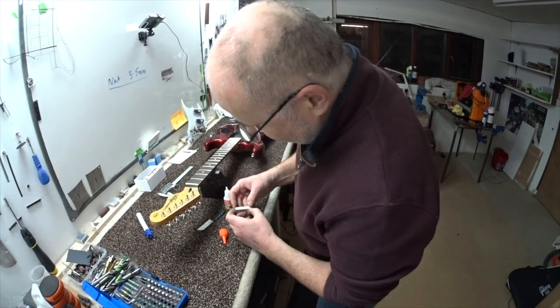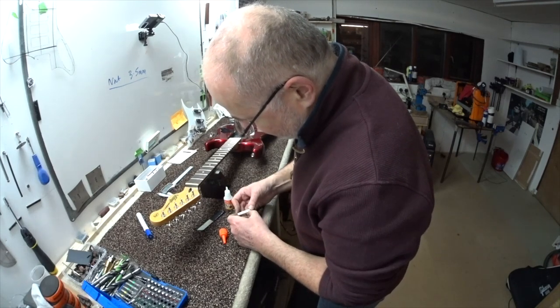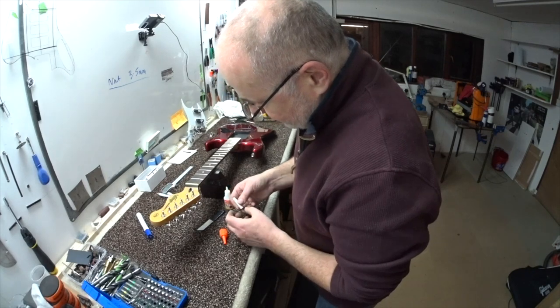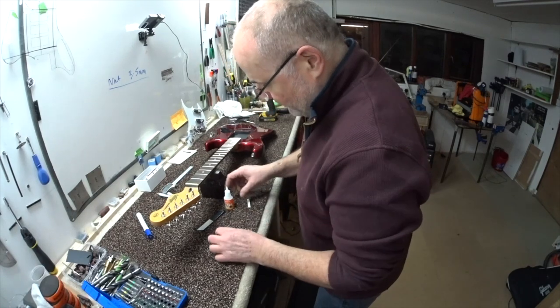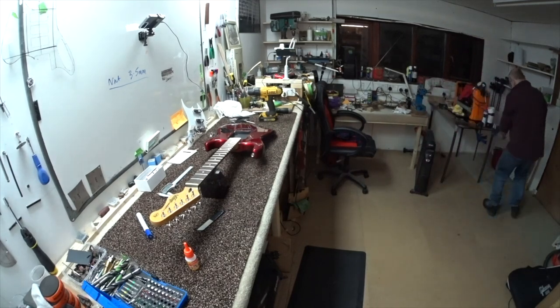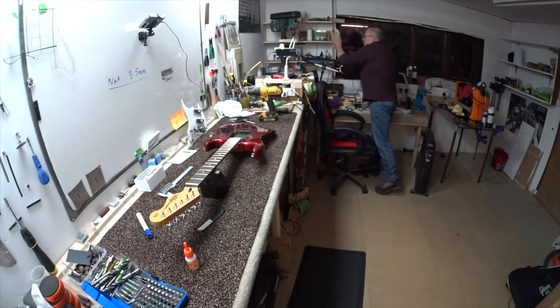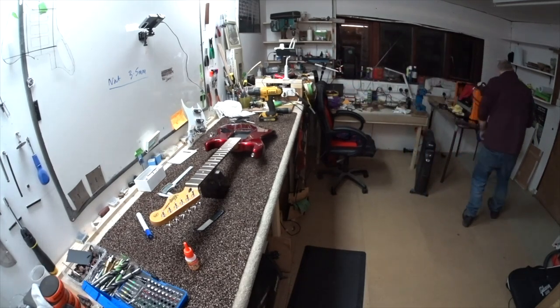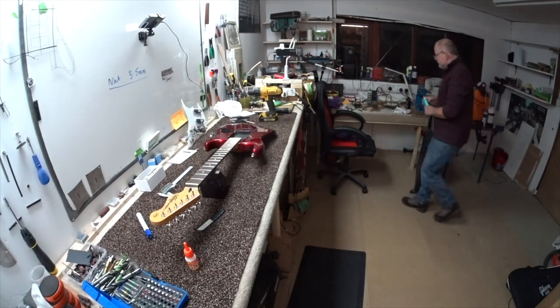Now I'm better off overhanging everywhere slightly before it sets. That's what I want, a bit of overhang, because I can afford a bit of overhang, and I'll sand it back when the time is right. So there's my bit of overhang built in. Now what I want to do is get it in the vise with a bit of a helping squeeze. And I could have some glue boost accelerator, which won't harm me to throw on there while we're at it.